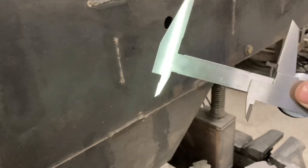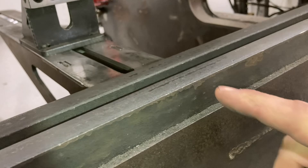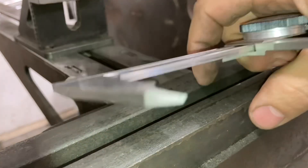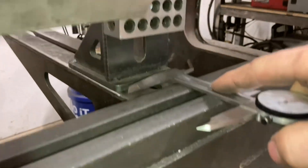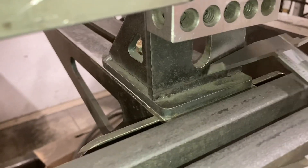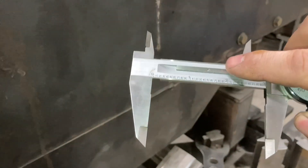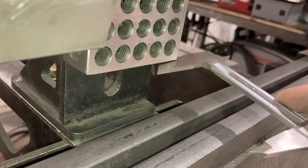But these parts I'm doing today need to be pretty accurate, so I'm setting them with this caliper. I basically use this edge to the end there, and I set it off of this surface because this is exactly two inches wide. So my center line of the die is one inch from here. Where the caliper actually touches, the die is touching down here an inch back. So I have to add two inches to my measurement. My measurement I'm shooting for on this part is one inch and eight thousandths, so I have this set at three inches and eight thousandths to account for this extra inch and then this extra inch.